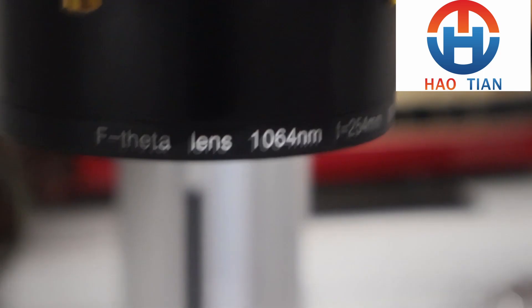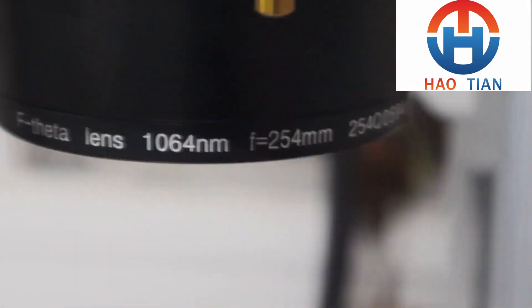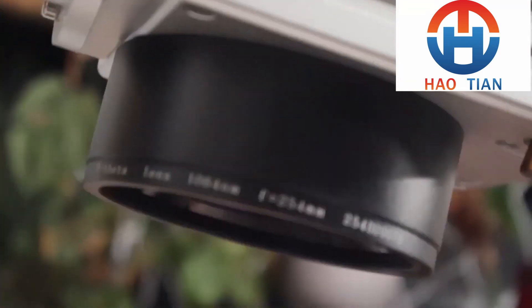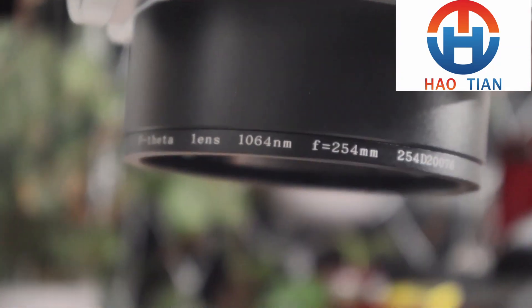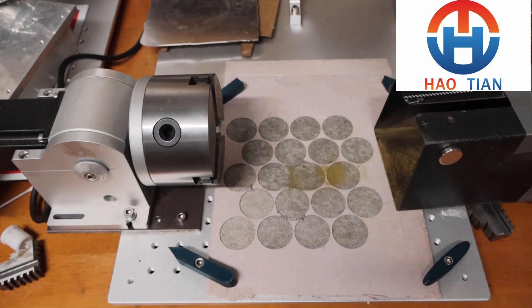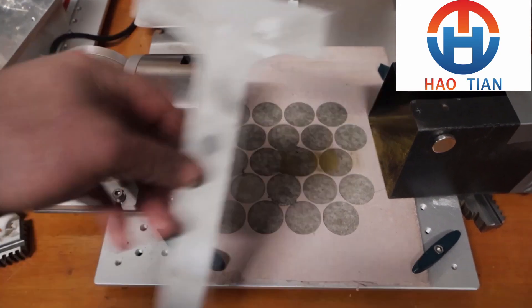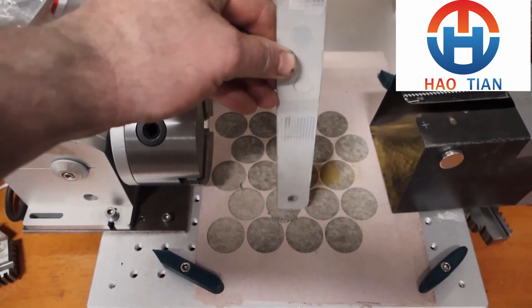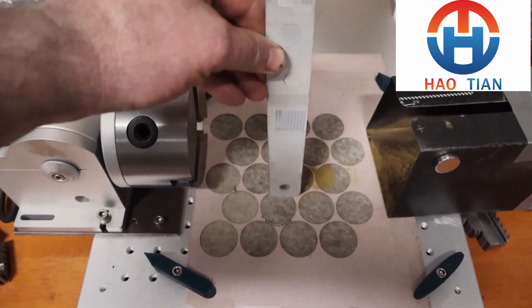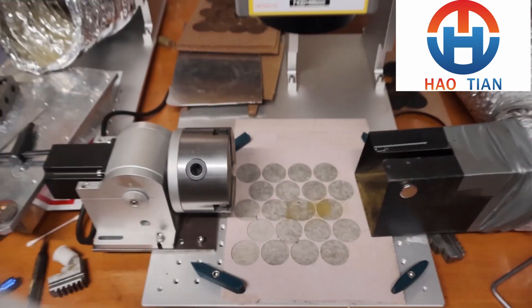I have several lenses for my machine. I do everything on the 175mm lens on both machines, as that's the minimum size I can use for my usual projects. It also allows me to do 20 coins at a time, which is really quite handy. Focus is critical — before you start, make sure your laser is in focus, and leave it in focus. Find a way to do everything you ever want to do with your laser in focus. It's that simple.